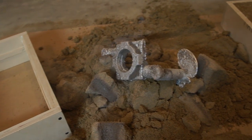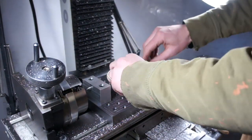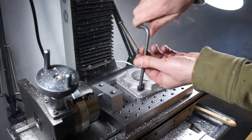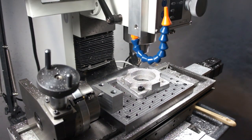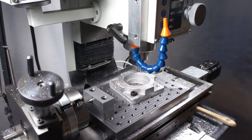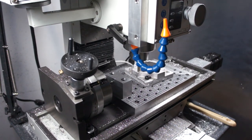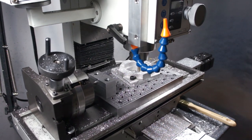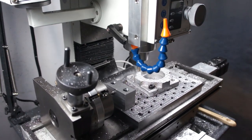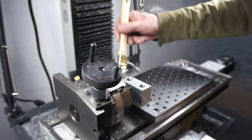There's the part with the sprue and riser still attached. The next step is to cut the sprue and riser off and mill all the surfaces flat. I'm going to bolt it to the fixture plate on my milling machine. The back of this piece isn't flat yet so I'll rough out the front, then flip it to get registration surfaces. Here I just have a beater end mill because there might be a little bit of sand particles in the aluminum, so I'll manually run the mill over the top just to take that surface off and give us a nice dead flat surface. Since it's registering to the concrete lathe, the concrete surface isn't ultra flat so I'm not super critical, but getting it close to flat helps a lot.